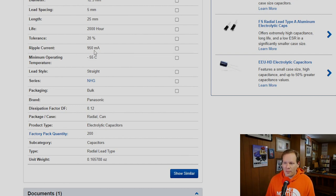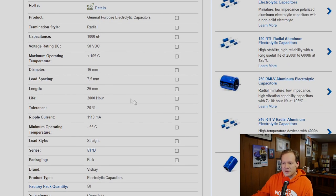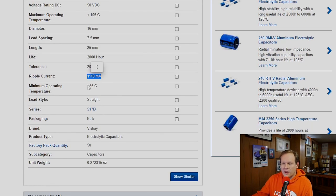To make a long story short, I screwed up. The rating is not tied to adding additional current to the ripple — it's just how much the capacitor can withstand on the ripple. So a higher rating should in fact be a better indicator for how long the capacitor should live, meaning it should be a better capacitor if it has a higher ripple current rating. Here's another producer, Nichicon, that makes a similar capacitor, and it does have a slightly higher ripple current rating.